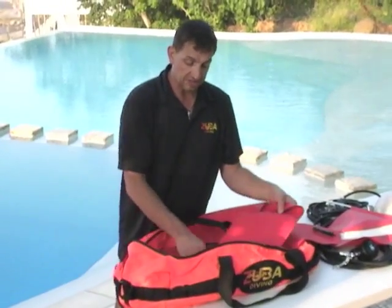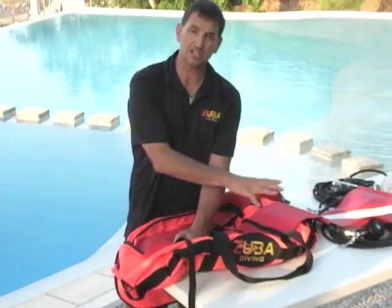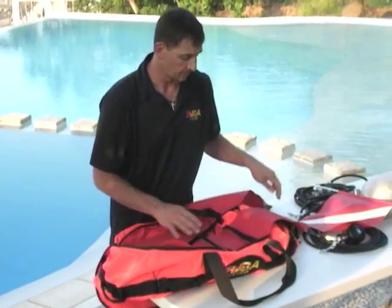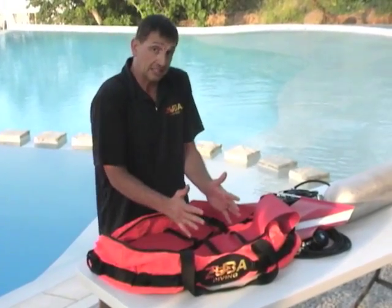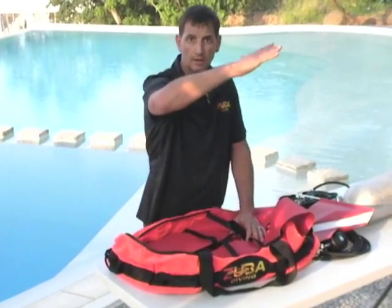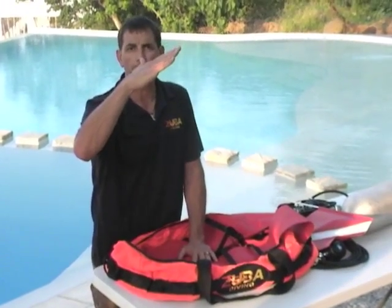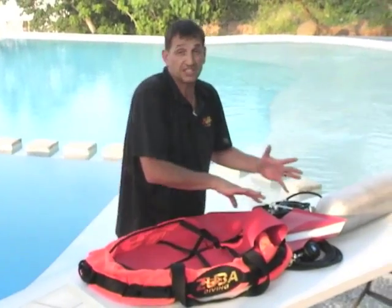You'll notice there are straps inside that the pontoons go into. You can cinch down the strap, changing where the lift is. I normally leave them all open because I'm deciding where to put the cylinder for lift. I can place the cylinder towards the rear or towards the front of the bag — that changes the angle of attack. If I've got a lot of weight in the bag, the cylinder goes more forward, weight goes to the back, and it picks up like a pontoon. You want this thing to ride like a zodiac on the surface — not nosedive. So push the cylinder as far back as possible.